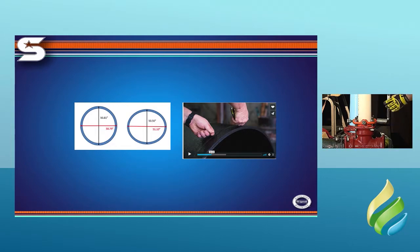On the larger diameter pipe, because you're not working vertical very often, you want to make sure this is centered. This is 12-inch pipe. There's not a lot of play. Trust me, on a 36, 42, 48-inch pipe, there's a lot more play in there. You can use wedges or something, because gravity is going to pull it down. Put a wedge in the top, pull that up.